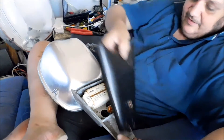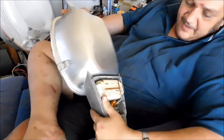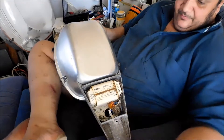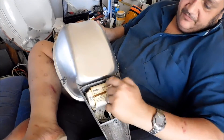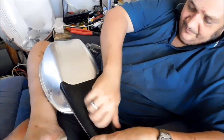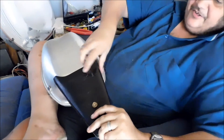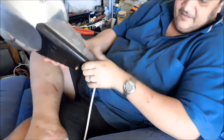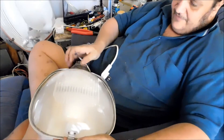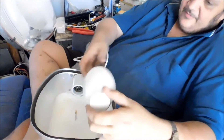Unfortunately the little hinge part has broken off the end — they would normally hinge back like this. The simple idea with it is there is not a lot of room in there for an igniter, so that's why they brought them out with the 175 watt mercury ballast. But they were initially intended to have the Unilux lamp in them. This is just to restore this old beast to what it came out of the factory as. They are a personal favourite fitting of mine, ever since I saw one being installed as a kid outside my parents' house.